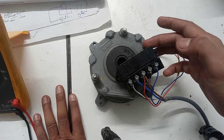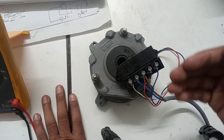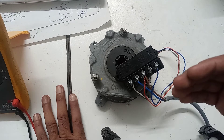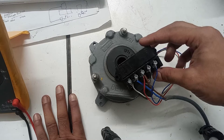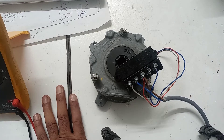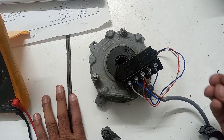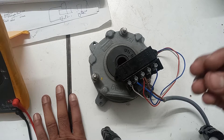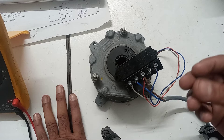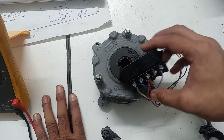After 120 milliseconds, the accelerating coil plus fractional coil get the supply, which increases the resistance of the coil and reduces the current. This helps to minimize the thermal level of the brake by reducing current and also increases the life of the brake. The main purpose of the fractional coil is that when we want to de-latch the brake and disconnect the supply, due to the high resistance of the coil it de-magnetizes very quickly.